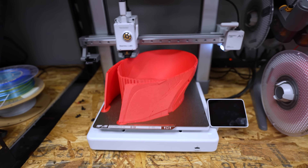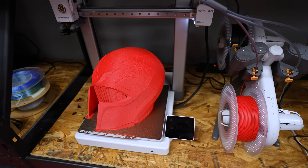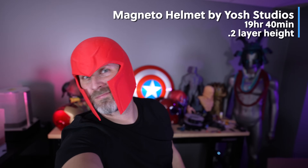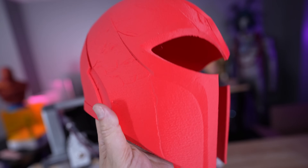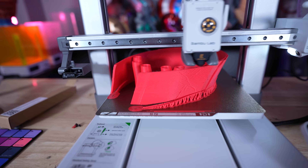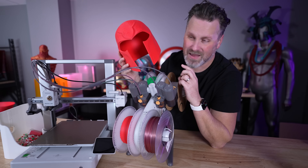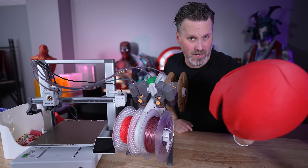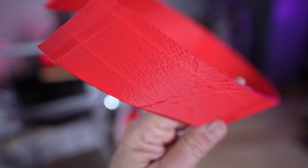Since I love cosplay stuff, I wanted to print a full-size helmet. I threw down a Magneto helmet that printed in just under 20 hours at 0.2mm layer height and it looks so good — a 24-inch version from Yosh Studios and the quality is phenomenal. Unfortunately the first attempt failed as the print started separating from the supports, but re-slicing and restarting worked much better, and the completed version shows no banding issues.